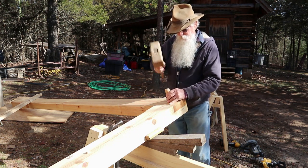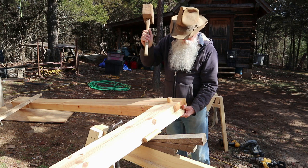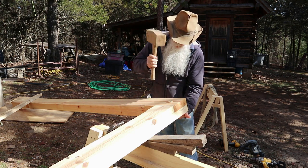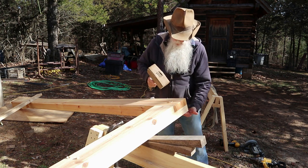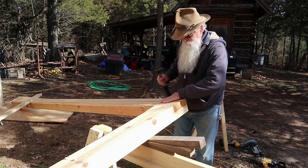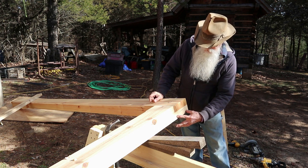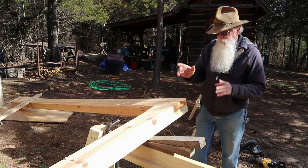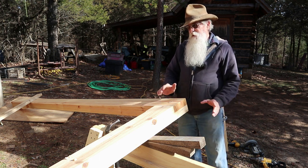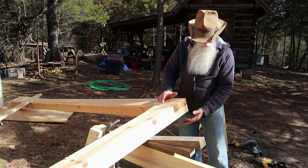Let's see how well this thing goes in. Let's finish this up with my hammer here. Yeah, that'll hold that together. I'll go ahead and put another screw in between these two here and the two on the ends. I've learned a lesson — I went ahead and put the one in the center in, and then when I drilled this hole I hit my screw and had to stop and sharpen my bit. So I've learned to just put one on either side and then come back and put the center one in.